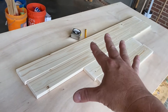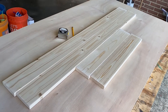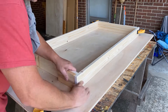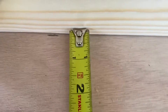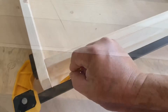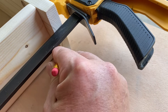I'm gonna lay this out on here and then build the jig around the frame. We won't assemble it together yet, but we'll put it together the way we would want it and then establish some contact points around it. Our board is 32 inches wide and our frame is 23 inches wide, so we want our frame about four and a half inches from each side — we'll mark that off. Then I'm going to mark a line on the outside edges of our frame to give me a reference point so I can put down some contact pieces in just a minute.